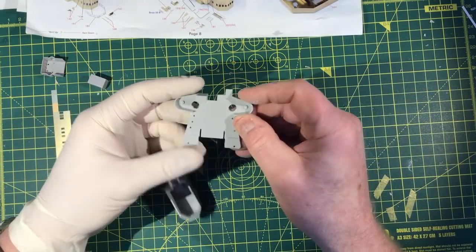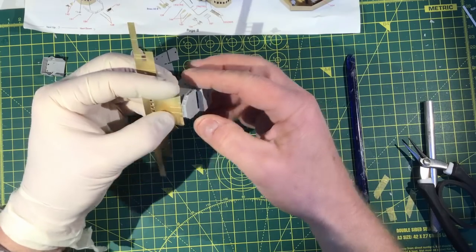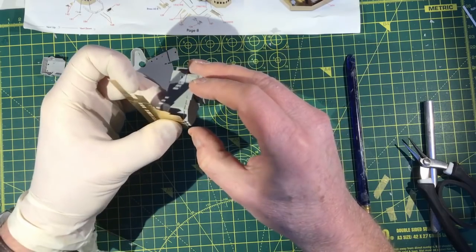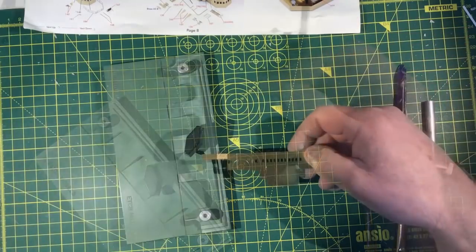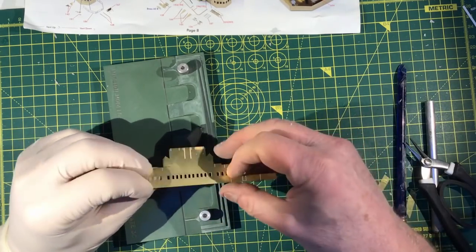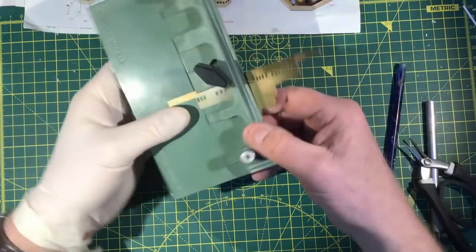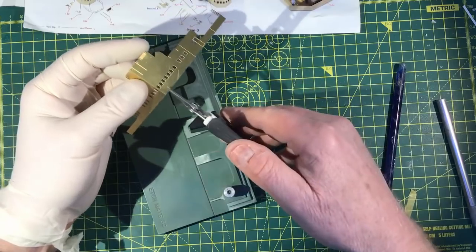So that's what the part should look like after the surgery. That part there is surrounded by this new section of brass. The lower part of that is the new chart house section. So I'll just start to shape that. And I'm going to use the bending tool, certainly for these long sections here. Once you get the bend going with the tool, it's easy enough then to finally adjust it with the pliers.